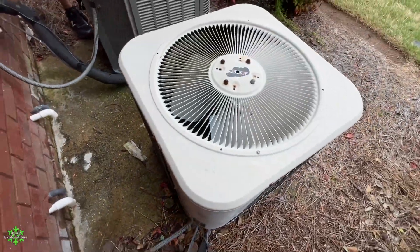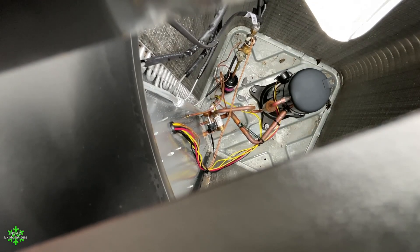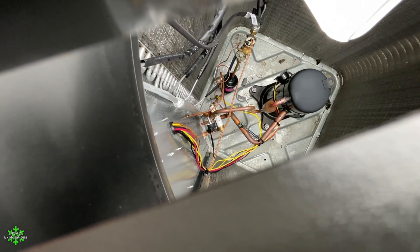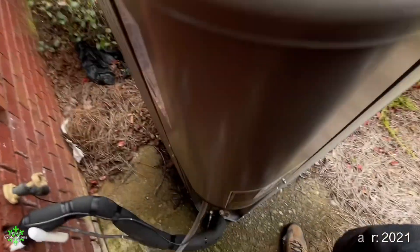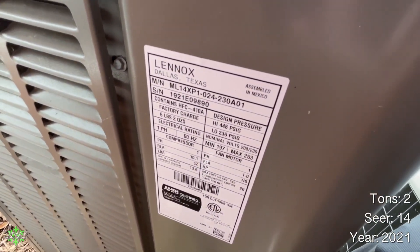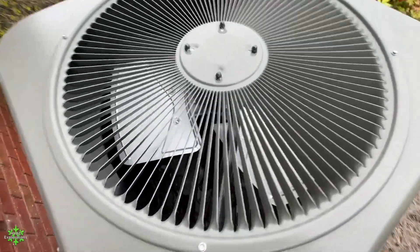Watch it — it may have been running in heat mode. It's also warm enough for the air conditioning. Notice how Lennox does not paint the base pans — that's pure metal. They also don't use suction accumulators. Does this one have one? It's a 2021 two-ton — almost looks like it does on the 14 SEER, but I don't think it does.